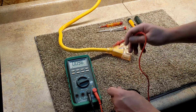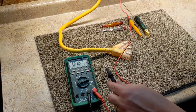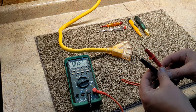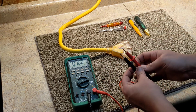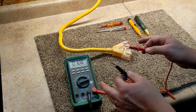You can touch voltage on a circuit anywhere you want to check. The best way to check on hot circuits: put one lead to ground, then take the other one and just check — what's my voltage here, what's my voltage here? That's the big thing about voltage — just checking it, what devices to use, and making sure you put the probes where you want them. It doesn't matter which order — it's not a sequence.